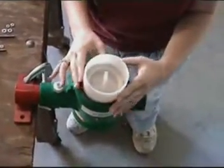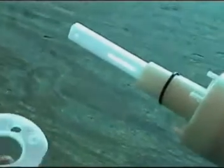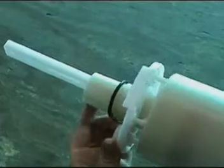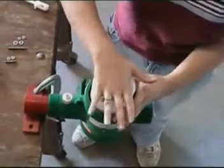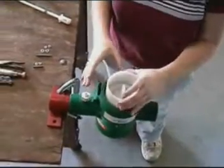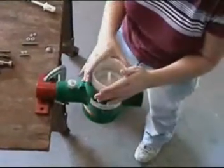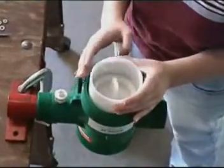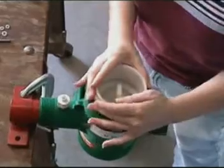As illustrated here outside the main body, the legs on the cylinder must fit into the sockets on the valve seat plate already installed. Push the cylinder down with a flat hand. Do not cup the hand to prevent pinching when the cylinder seats into the body. Turn the cylinder to make sure that it is in the sockets. If it turns more than a few degrees, it is not set. Pull the cylinder up about 1/4 inch and turn until it seats into the sockets.